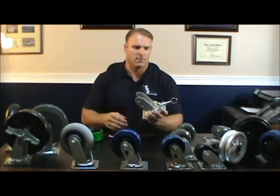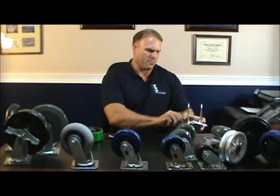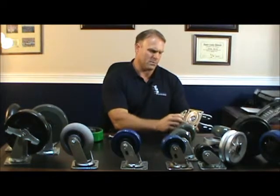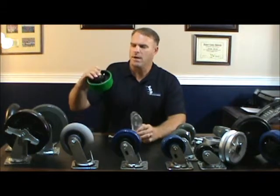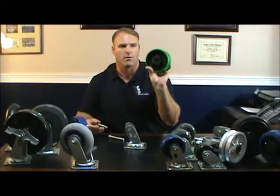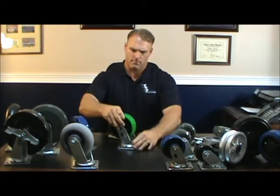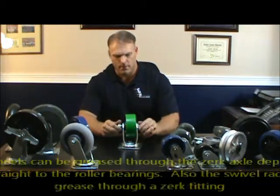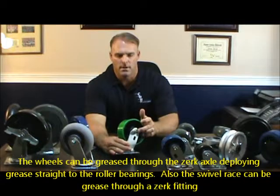One of the main features of this series is the multitude of wheel applications. To show you how a standard medium duty series caster goes together, I'm going to take this 4-position swivel lock off for demonstration purposes — those can be bolted on in the field at any time. This is a polyurethane on cast iron wheel, a five inch caster. The wheel has a straight roller bearing in it with a grease fitting, and a half inch ID spanner bushing that goes through the axle and mounts into the rig. These axles also have a zerk fitting so you can shoot grease into the roller bearing from the axle.